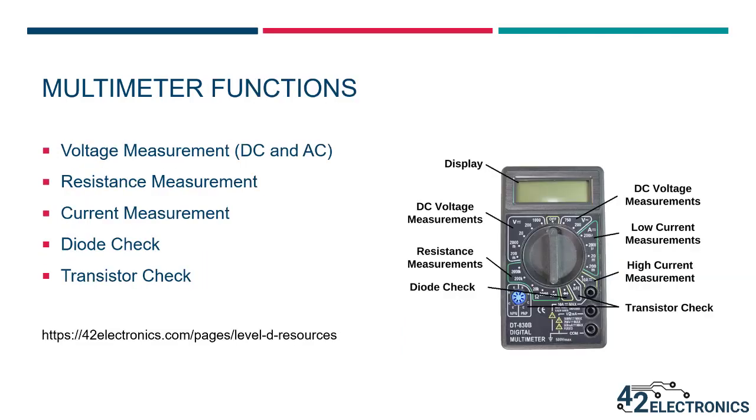So let's briefly walk through the functions available on the multimeter from your Level D kit. It has voltage measurement, both DC and AC, resistance measurement, current measurement, diode check, and transistor check. The voltage, resistance, and current measurements will be covered in the next video. The diode and transistor checking functions won't be covered in this lesson due to the complexity of connecting these devices to the multimeter and then interpreting the readings on the screen. But for more information on these functions, you can visit the Level D resources page on the 42 Electronics website.